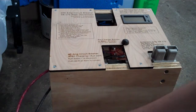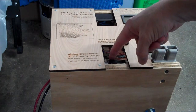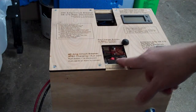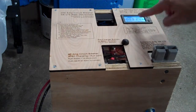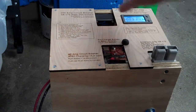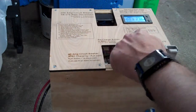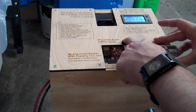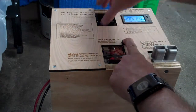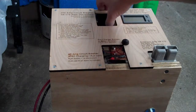This is the final battery. Over here is the charging connector — it's an XT60 that just kind of hangs off the side. That's connected to this auxiliary circuit breaker; I leave it off unless I'm charging. I have the main Anderson SB175 connector bolted on there. When I turn this on, the panel meter gets power — I'm at 24 volts right now. I also have the pre-charge button. If the main breaker is off, that pre-charge button will provide power to both the panel meter and this connector through that 50-ohm resistor. It only goes up to about 23 volts because there's a voltage drop across the resistor. But if I had something with capacitors plugged in, this would charge it up and then I could safely turn on the main breaker without any inrush current that might damage anything on the inverter side. So that's the battery. Now we're moving on to the next video, which will be the inverter. I'll see you next time.